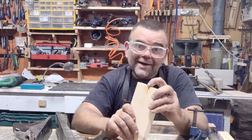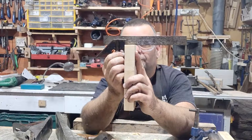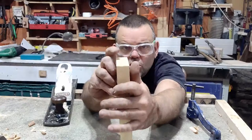Don't do it like this one, because although I did it for demonstration, it's not square on the end. You will need to put a mark around with a marking knife and a pencil to show you where to plane to. There's a gap under that edge because I was planing it square — but there you go, I wasn't really trying to. So I'm going to plane this end of this piece of timber on the end grain using a shooting board.